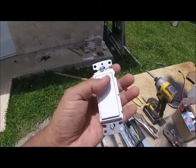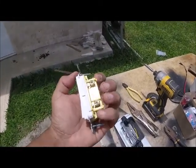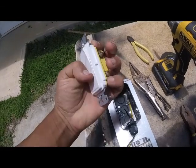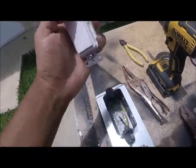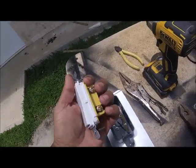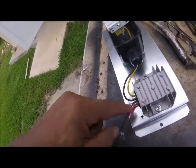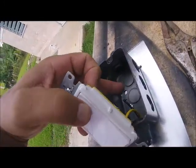This is going to be a hands-through walk-through — baby electrician 101. The top of the switch where you can read — this one's a Hubbell, a very good switch. This one down here is where you hook up your first positive. So this yellow one goes down here. The first positive goes here, and then this is the cutoff. This one right here is also going to be positive once you hit the switch, and that's going to go to the positive of your light bulb. Let's hook up the first positive down here, which is the hot cable. Remember, this is positive and negative — but of the 12 volts. 48 volts goes in through here, positive and negative, and comes out positive and negative at 12 volts. Don't make the newbie mistake of hooking this one here — that's just dumb.